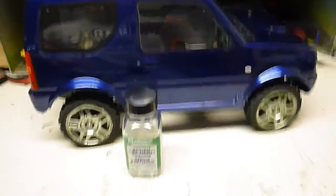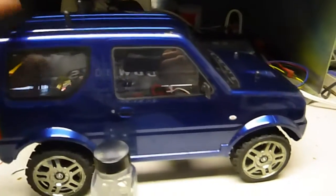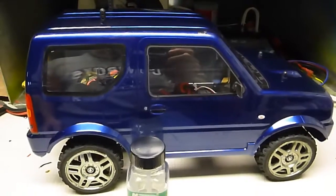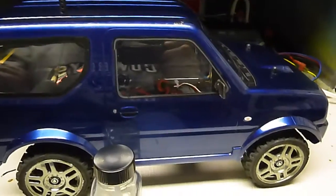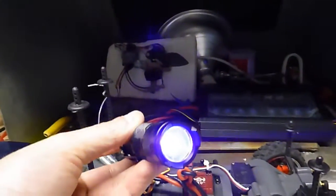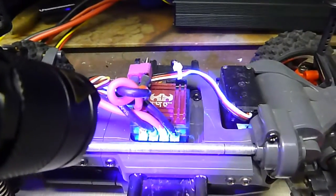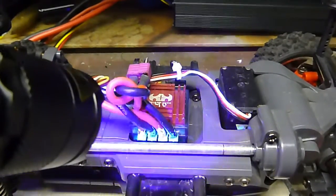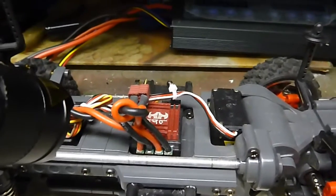I'm here with another great tip. The other day I rode this truck out in the snow and I was wondering if I had coated my ESC with conformal coating. I found out that if you shine a UV light at your ESC, you can see around the wires and board — it glows a whitish green color. That's how you can detect if you coated your electronics, even if you forget which ones you did.